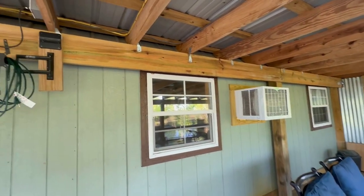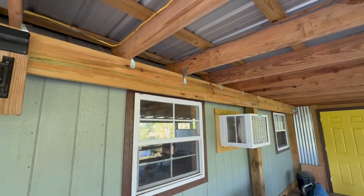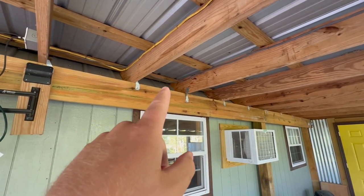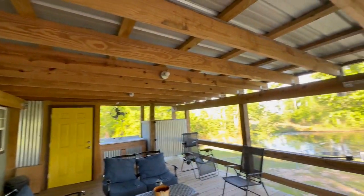In this case it's a tiny home, so there wouldn't have been enough structure inside the home to attach to anyway. They were able to get their upper joist in, angle it, and then do their flashing detail for the existing roof onto the new roof so that you don't have a water intrusion problem.